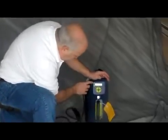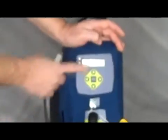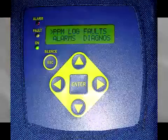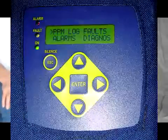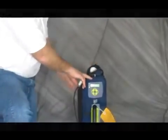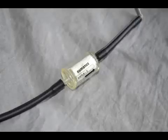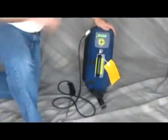There's a fault light on the unit — how does that go on? If I cover this thing, you'll see that it faults up, and when I clear it, it goes away. Inside the menu, you can actually go look and it will give you a report of the different faults and what happened. You'll get different faults: ones for the filter being blocked up — this filter will occasionally need to be replaced and that will show up as a fault. You'll get a blockage fault, and that sort of thing can be found inside the menu.